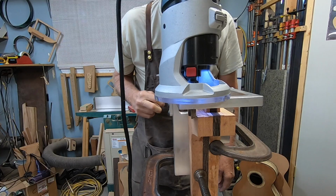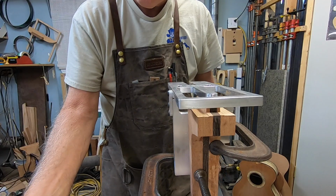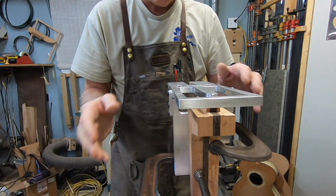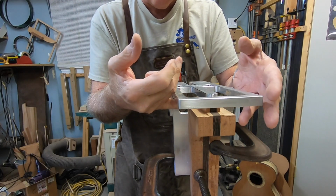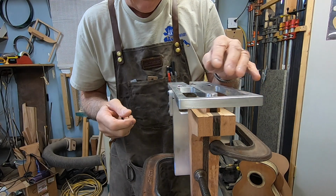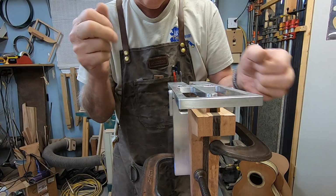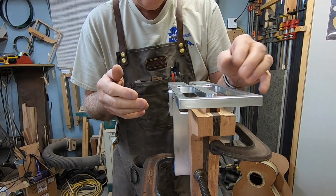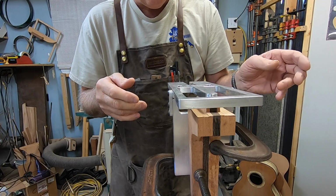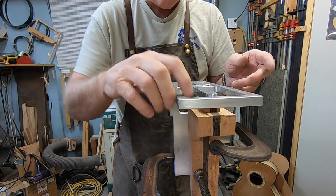Okay, we're back in on the neck tenon. The last couple times I did this, I just started with the full heel without any pre-cut in here. This time I laid it out and cut it on my bandsaw and then some handsaw, because one way it fits on the bandsaw and the other way it hits the thing at the wrong angle. Anyway, I got that cleaned up, and so now we only have to take off a very little amount with the actual router.